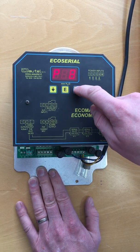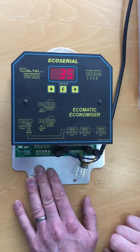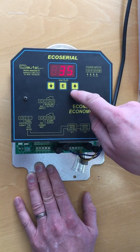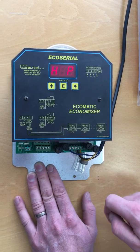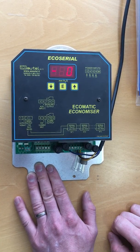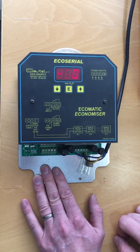Furthermore, you can change the settings for the start cleaning pressure and the stop cleaning pressure. These settings you change by simply going up and down on the increase and decrease arrows. Finally, you need to scroll up to HP, then press Enter firmly, and this will store the settings into non-volatile memory, which means that the changes you've made will still be in force following a power cycle.